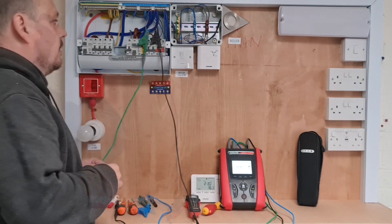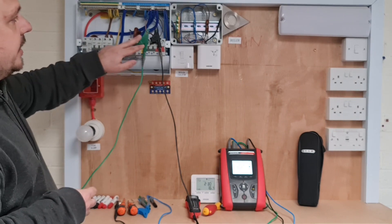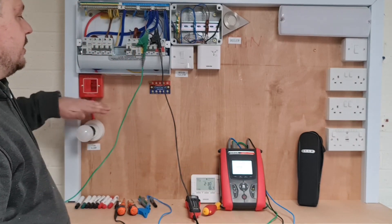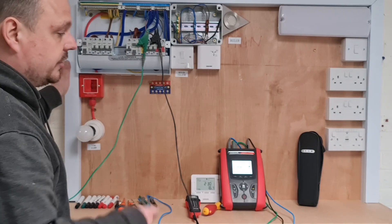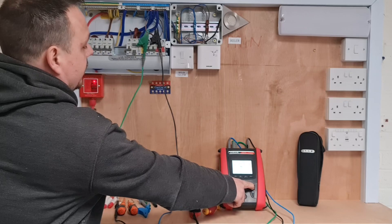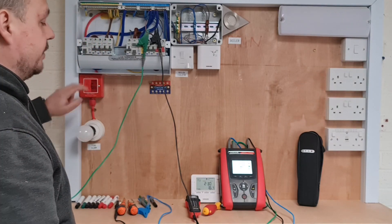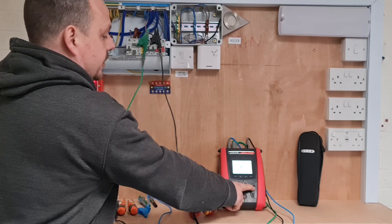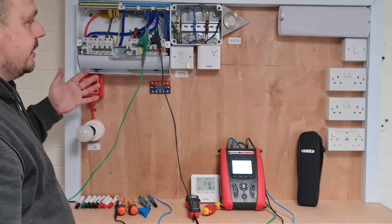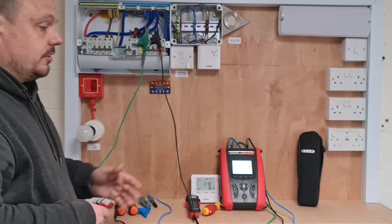We can split the test as well. On the fire alarm circuit here, I can test between line and neutral with the isolator in the off position. So this is going to test the cabling down to the incoming terminals on this fire alarm isolator. And you'll see it measures above 500 mega ohms. Now if I was to switch it into the on position and repeat that test, you'll see the neon and the lamp illuminate. I'm getting an insulation resistance value of 0.22 mega ohms - both the neon and the lamp came on. So it's essentially providing power to the circuit and also measuring load insulation resistance because it's running through that neon and through this lamp, giving us a reading that's saying that the circuit's faulty.